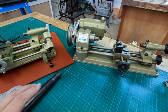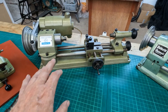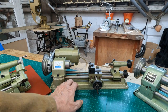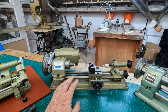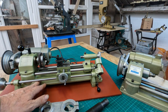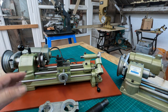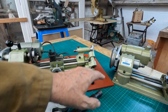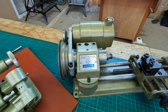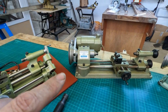That's quite a simple way to tell them apart. Now, a lot of these have the lighter castings, weight-wise. I couldn't tell you whether having one with the heavier castings is a better thing. When you look at the one with the aluminium handles, some of them have the heavy castings and some have the light - there seems to be a mix. These are, as we can see from the name badge, a Unimat SL, or in the US, a Unimat DB.